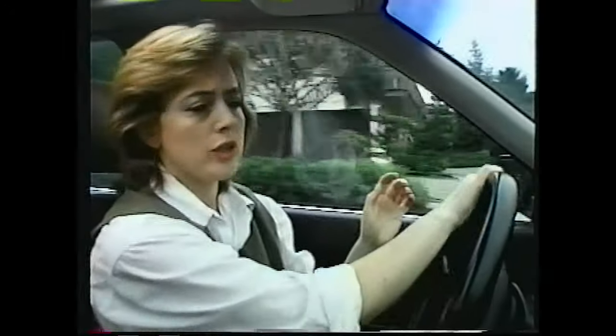And also be careful of the temperatures that you charge them at, because you don't want to charge them at temperatures above 86 degrees Fahrenheit and 30 degrees Celsius, or below 50 degrees Fahrenheit and 10 degrees Celsius.